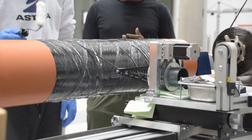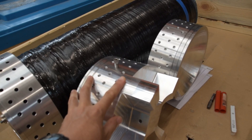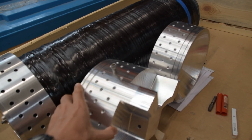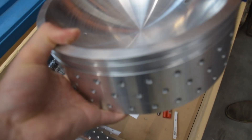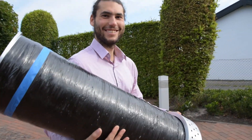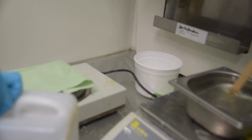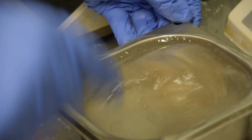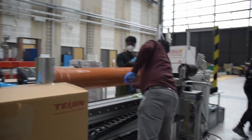Our first idea on how to approach this was just to build a carbon fiber tube and then attach two aluminum bulkheads via bolts onto each end, thus creating a tank. This decision was mainly a function of the tools that we had access to. First of all, we had a sponsor, Aljo, which was willing to build our bulkheads for free. This made this design a little bit cheaper than it would have been if we had to buy those bulkheads on the market. And secondly, we were able to manufacture the carbon fiber tube really easily because we had access to a carbon fiber winding machine at the FASN Institute, which is another one of our sponsors.